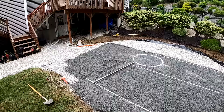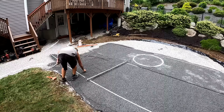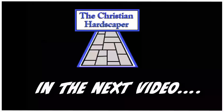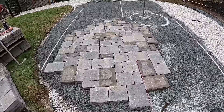That's going to be wrapping up this video. A few key takeaways: if you don't have this particular material or something comparable available in your area, I would recommend a small 3/8-inch crushed pea stone. If that's not available and your only options are mason sand or stone dust, always go with the sand. Stone dust has been proven and tested to not be good for your concrete pavers or natural stone — it holds water like a sponge and really deteriorates your product. Check out our next video on how we laid the pavers, and give the channel a subscribe so you can see more like this. Thanks, guys — we'll see you next time.